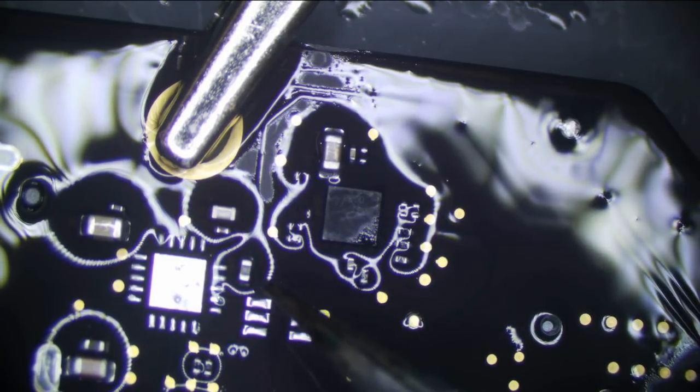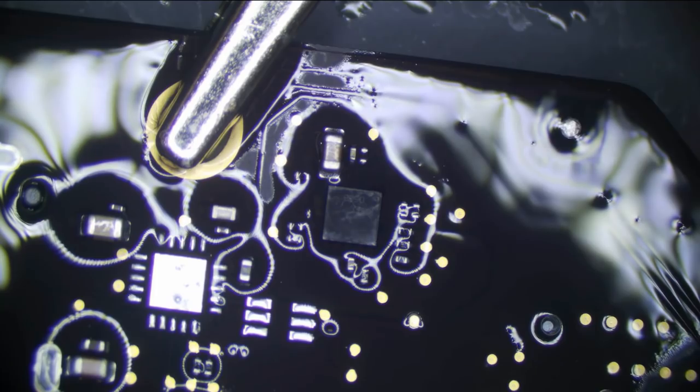Is it one of these Thunderbolt caps? Alright, it's something in this area. I don't know what because... This cap looks a little bit off right here. Okay, I'm going to use freeze spray because I can't find what it is. It's something right here and you know what? It's this cap. It's this little sucker right here.